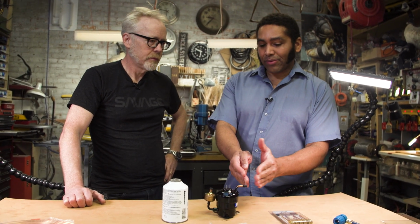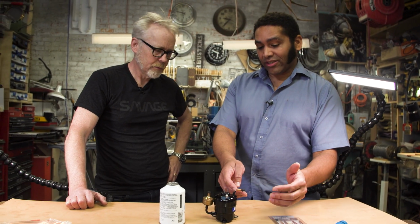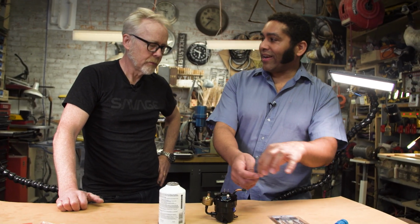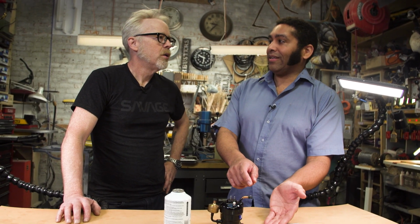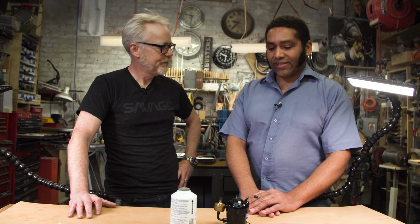So we take that constant pressure gas, we blow the air over it, and the reason why the pressure doesn't change is because even if we take all of that heat away, there's more new gas coming in from the back end. So what happens is not that it changes pressure, but it changes state. We go from gas to liquid. I see. So because we're taking temperature out, we can fit more gas in the same volume. We can fit more gas in the same volume.